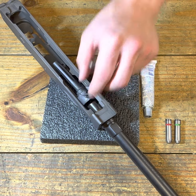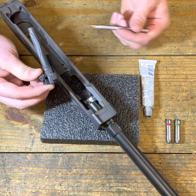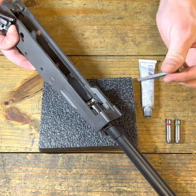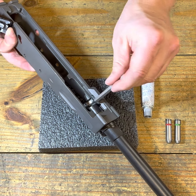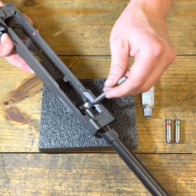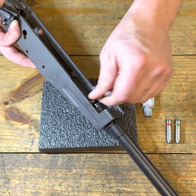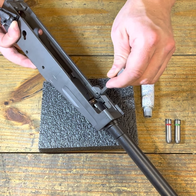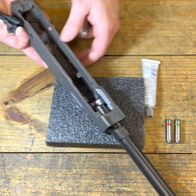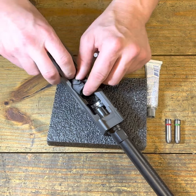Some makers — you may have to profile this ejector down. Don't use a Dremel; please use files and go slow. This is not something that you want to goon up. Don't make it too short because you got too aggressive removing material — you want to make sure you have plenty of clearance. If there's too much ejector on there, your stem is going to get kicked over to the left, and then our bolt face isn't going to be able to be flush, not allowing it to be aligned along the axis of the bore.